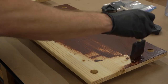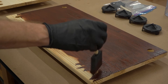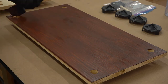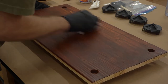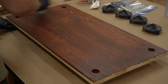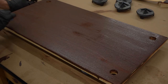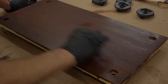But after three coats on a test piece, it still wasn't quite as dark and even as I wanted, so I decided to experiment a bit. For my first attempt, I brushed the stain on so that it was close to the final shade that I wanted. The problem with applying it this thin is that the stain dries quickly, and then it becomes sticky and impossible to wipe. It was at this point that I noticed just how bad the swirl marks were from using my random orbit sander, so instead of wiping off the stain with mineral spirits while it was still possible, I let it dry for a day, came back, and sanded off the stain and the swirl marks with 80 and then 120-grit sandpaper. For the next attempt, I applied a thick coat of stain, but instead of wiping it off heavily, I wiped it off with just enough pressure to remove the excess, then wiped it with lighter and lighter passes until it was finally the shade that I wanted. On this pine, I found that it was easy to wipe off too much stain and end up with very contrasty grain.